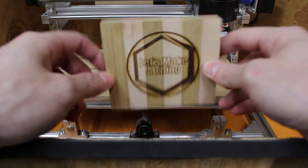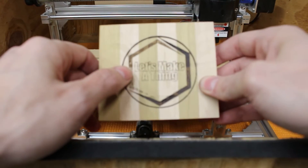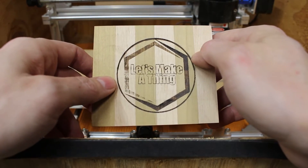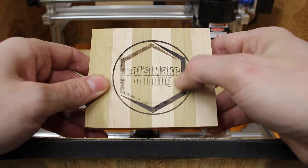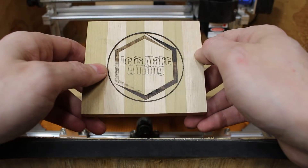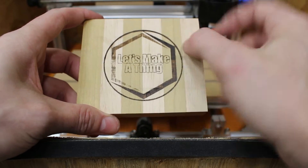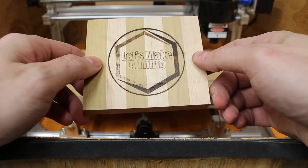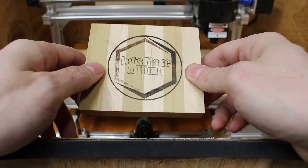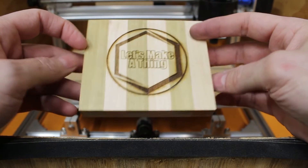So after a quick sand, this is the original, and that is the one we just did. Because of the tape, it didn't engrave as deeply, so sanding did take it off a little. It looks like I should have run the laser a little bit slower to get a deeper engrave. Sanding it down took some of the darkness with it, which makes me wonder if it's just soot making it look dark initially, and then cleaning it up takes the darkness away. It's still a little darker in the deeper areas — something I'm going to have to experiment with. I think I'm going to try running it a little slower and see how it affects it. Overall, it definitely has an effect, but I just don't know if it's worth the effort.